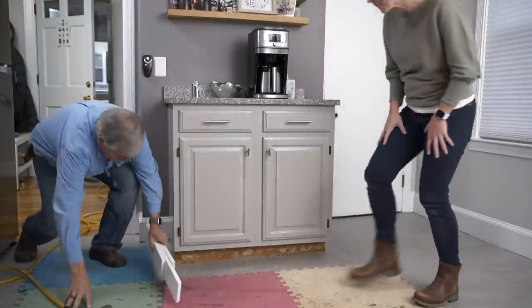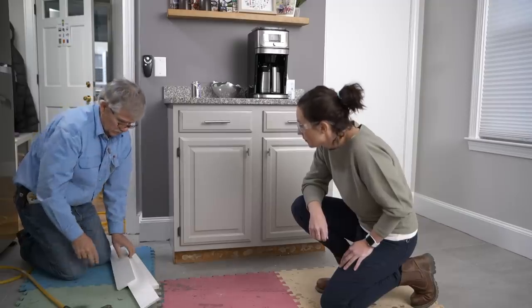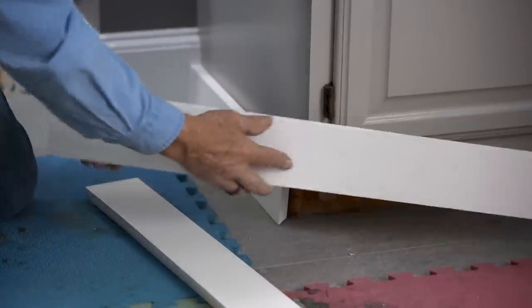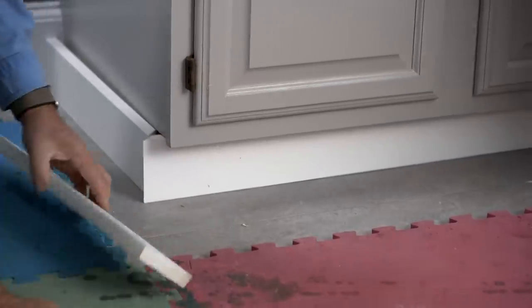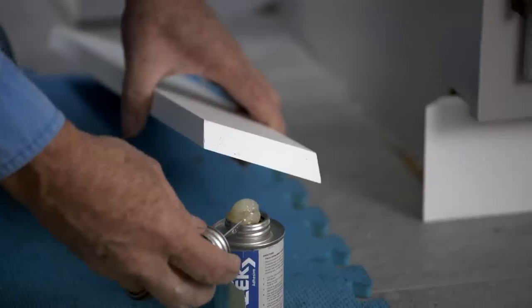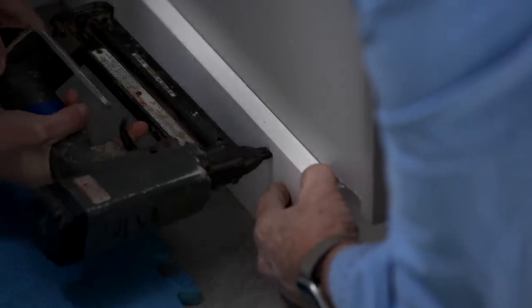I've pre-cut the pieces that go around this cabinet. We're going to do this one a little differently than the dishwasher — we're going to miter the outside corners. Over there we butted those pieces together so you can pull the base off if you ever need to service the washing machine. I've cut them to fit with miters on both ends of this middle piece. I'll slide it in loose first because I want to glue this joint first, then you'll nail it. This is specially designed cement for this PVC product — wipe it on.